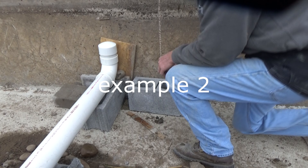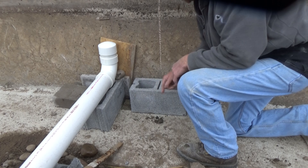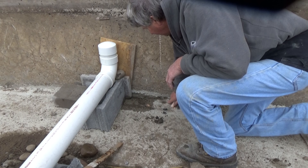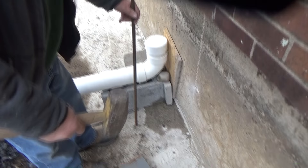I have to put a pilaster up this wall right here. All it has to be is an 8-inch block. The only thing a pilaster does is provide extra support. I'm already down on the footer. I'm going to make my couple of marks where the rods go in and drill into the footer right there and put a couple of rods in. Then we'll drill into the top two. Now we've put the rods in the footer.